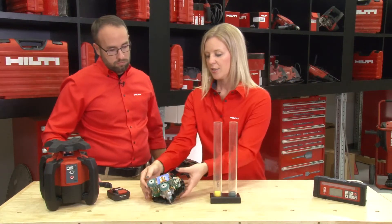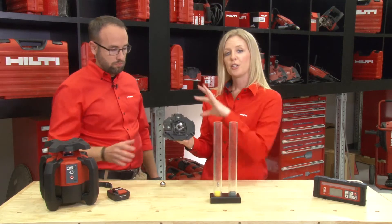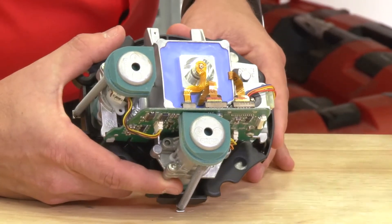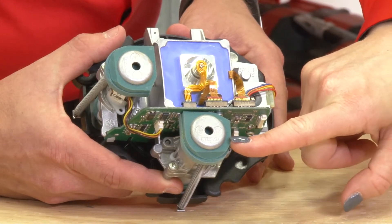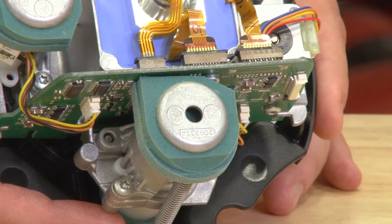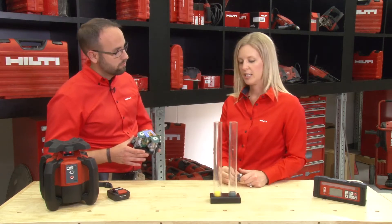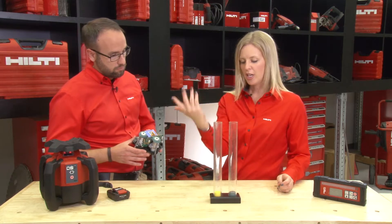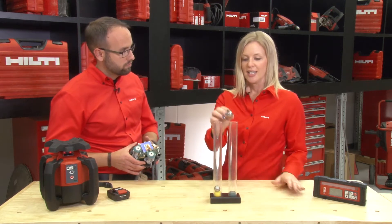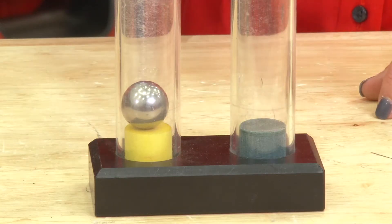The second piece is this green material on the inside of the core. You don't see that from the outside, but this is what the inside of the tool actually looks like. The green material is what absorbs the additional energy that does travel into the tool. I'm going to show you the difference of what the green does for you versus what you see in the market today. This yellow material is very commonly used as buffering material in the market — it doesn't really do a whole lot. The green material takes the immediate impact of the energy that comes in and absorbs it.